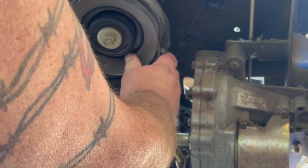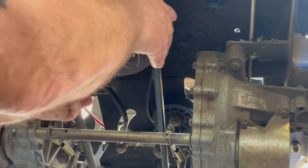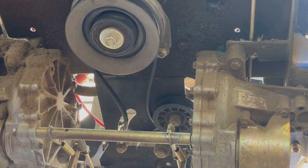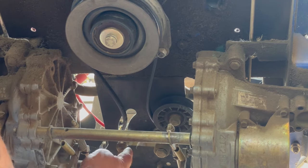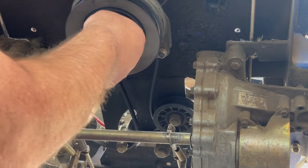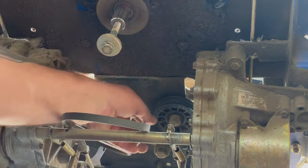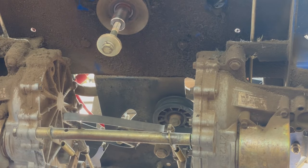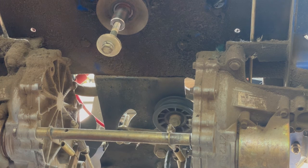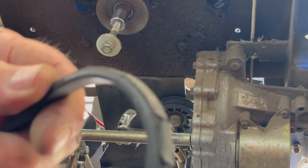I got to take the belt off. Here's where that idler pulley was — go ahead and pop the PTO clutch off. I took them off the hydros. The whole inside is burnt, some big cracks in it.